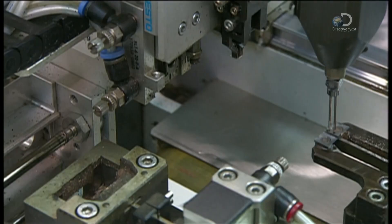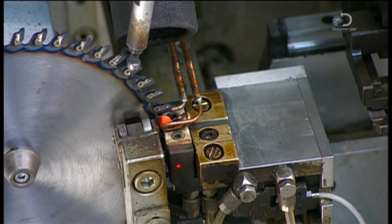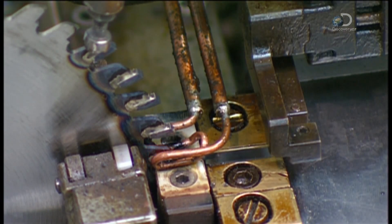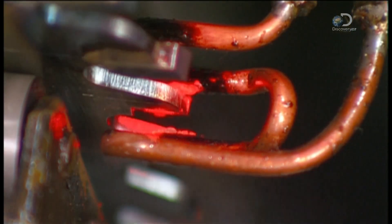The next robot delivers the tips to the saw blade body. Elements melt the solder metal in flux to fuse the carbide tips to the teeth — a technique called brazing. Teeth with carbide tips last longer without losing their sharpness.